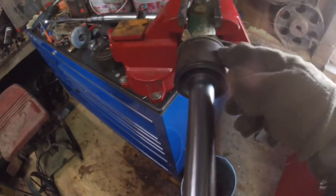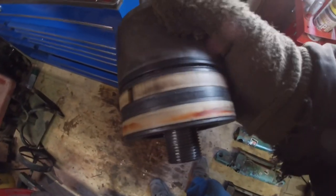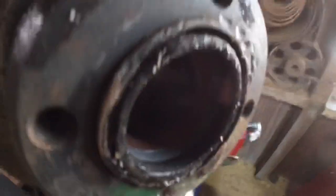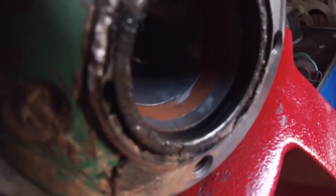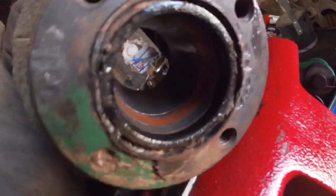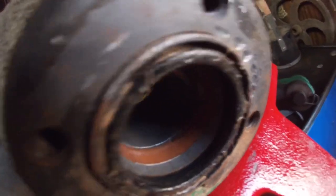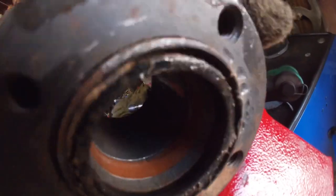Just like we used the piston as a slide hammer to get this out of the barrel, now we're going to slide hammer this piston off of here. Usually just a good swift stroke will get it off and then you don't have anything marred up. Let's take a look at this one and see how bad we wasted our time — well, it needs replaced too. If you can see it, there's a cut in it and it's old and brittle, and there's a chunk out of it. So this one was leaking externally too — that's no big deal. I'll order another kit and we'll rebuild this one as well.